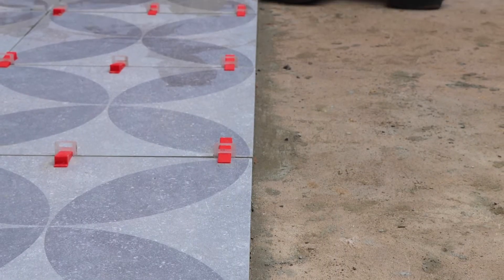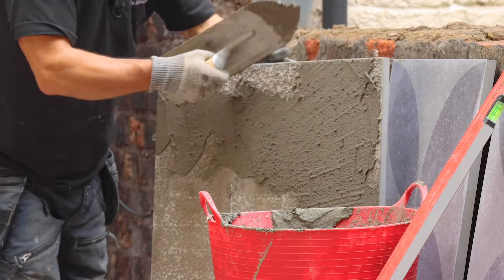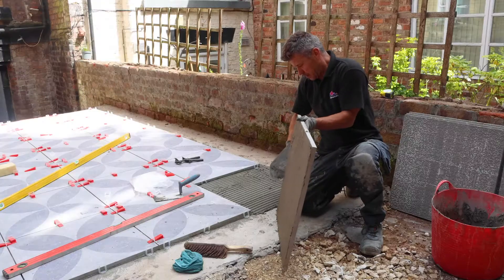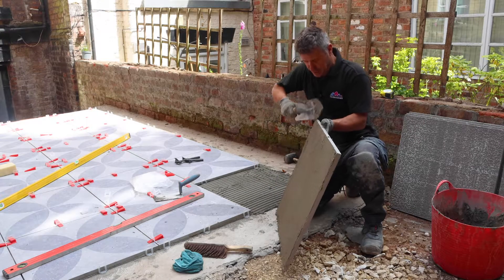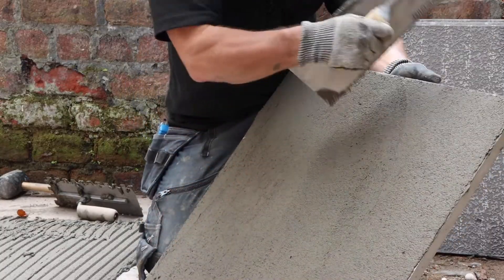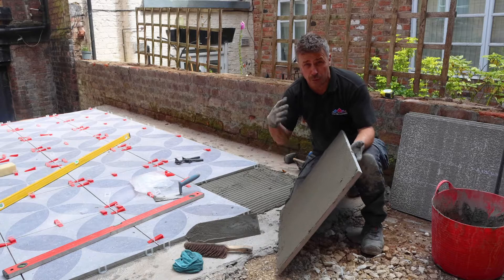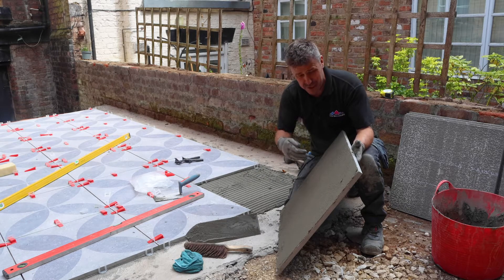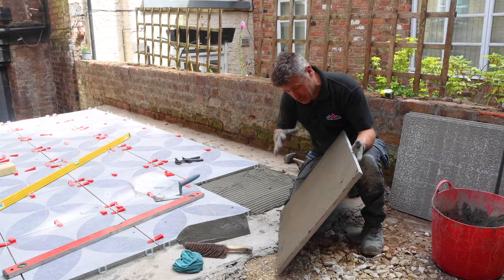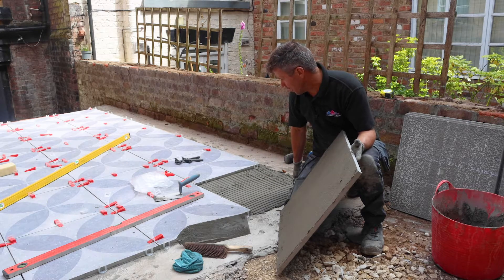The hard blue range is available in four colour variants: gray, dark gray, graphite and white. There are also three accompanied decor style tiles available which can be mixed. On all these tiles I've been applying a small, thin, smooth amount of tile adhesive along the back — only a couple of millimeters thick — and combing the base where they're going to be fixed. Most manufacturers recommend this for tiles 600mm square or larger, but do check, as it can also differ depending on what adhesive you're using and what base you're laying on.